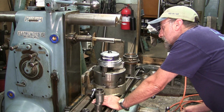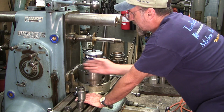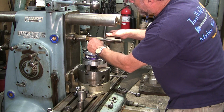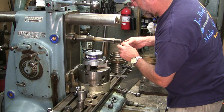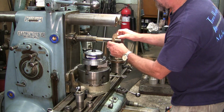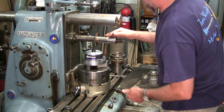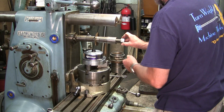All right, we're just setting that up there, but we want to see how we look, can we get close enough there. We're running out of room back here, and we're just about right on center there, so we're going to need to come out a little bit to be more comfortable. So I want to slide this key out. Yeah, we can come out a half inch or so. Then we'll put the cutter. We like that one. We're going to bring our bearing support out here and give ourselves some pretty wide open, clear throat depth in here.